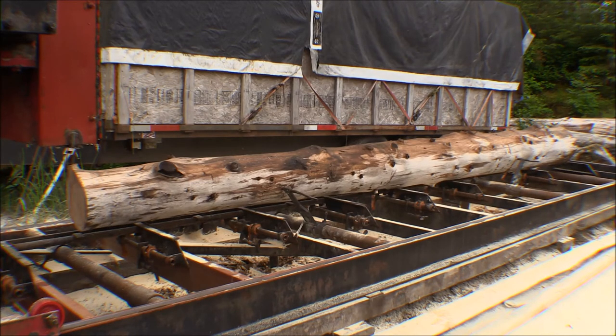So what I'll need to do is split the difference, which is a little over 2.5 inches, between one end and the other. Well, I'll jack this end up, lever this end up here, and stick a shim underneath it to lift it up. What I want is to be a little over 2.5 inches above the deck of the mill. Now, because of knots and things on the log, it's already sticking up on this end a little bit. It's probably not quite enough, but I'll go measure it and check, and then I'll block that up a little bit and get it stabilized to make the cut.